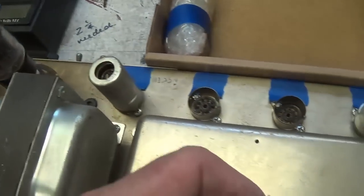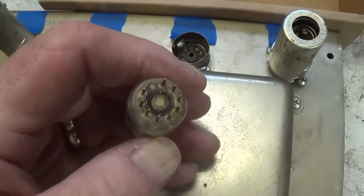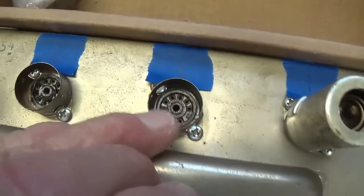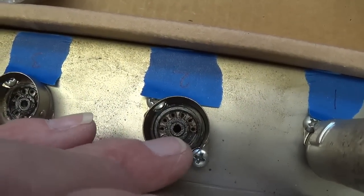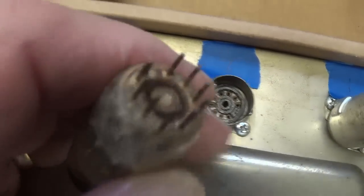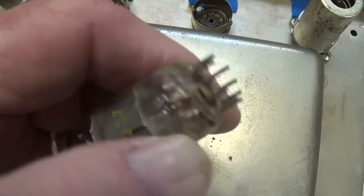Although the tube set is just a fabulous set of vintage RCA and Westinghouse tubes, much to my revulsion, the base of each of the tubes has been slathered with what looks like white grease. I don't know if that was to seal the air from the contact points with the socket, but you know darn well it prevents the contact between the tube pins and the socket. So the pins are having to be cleaned very thoroughly and the socket before I can insert each tube.